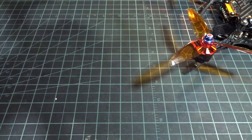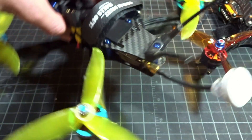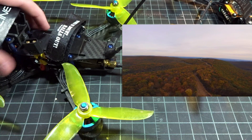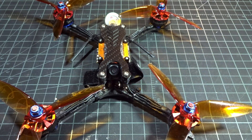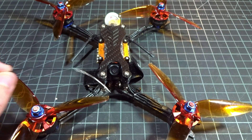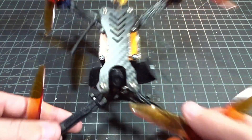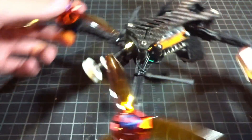My normal freestyle quad used for longer range flying has the antennas oriented upward, which is much better for long range when you turn at low angles — that one just has a stock XSR with 1/5th wavelength antennas, and I get fantastic range from it. So I really don't think leaving the stock antennas will be too much of an issue. However, for any long range flying with this receiver I'd recommend changing to the 31mm antennas and perhaps even hooking up an XM Plus as a slave receiver, which is a nice feature. If you're going that far for long range, you might as well look into a crossfire system. As for the RSSI values flying over the lake, this is a race quad with antennas mounted below, so it wasn't optimal — but it seemed to do the job just fine.